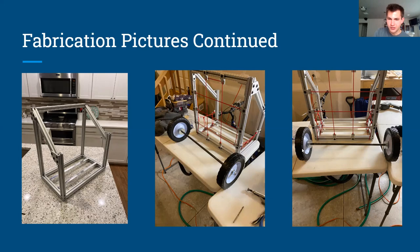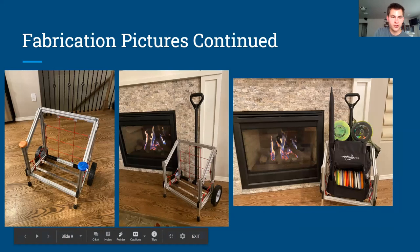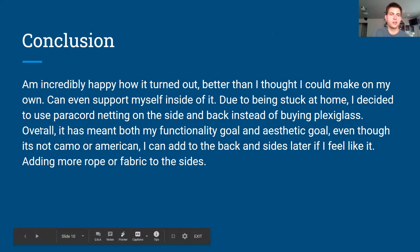Since I was at home without easy access to buy acrylic, I found a lot of old strings and did some webbing patterns on the back and sides of the cart. For the axle, I used a steel shaft, tapped outside screws, and added lawnmower wheels with spacers on either side. I finished attaching the wheels, added front pegs made from aluminum with rubber bottoms to keep the frame balanced. I also bought a steel shovel handle from Walmart for five dollars, drilled holes in it, and attached it as the cart handle.